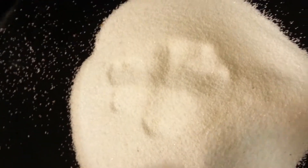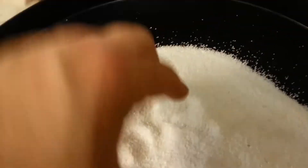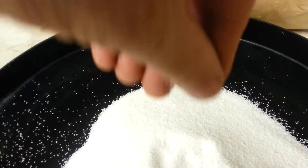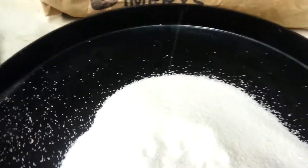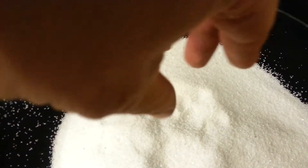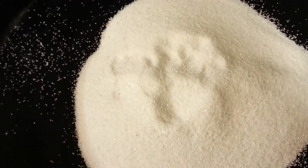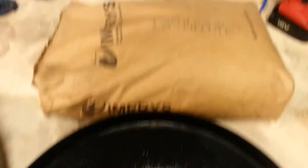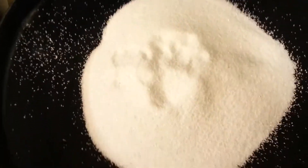This here is the Emory's Calcite. It's nice and fine. One other thing about this is it is made out of pure marble — it is not made out of limestone. If you're using a product that's made out of limestone, you could be getting 20% solids that are not going to dissolve into the water, and therefore it's 20% less effective than Emory's Calcite. There are some other brands out there, but I know that this one is NSF certified, and that's why I use this particular brand and type.